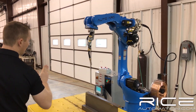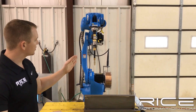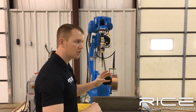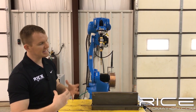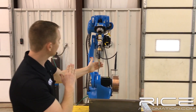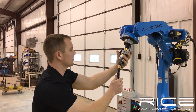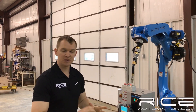The last thing on this robot body is the torch. It does come standard with a breakaway torch. What's great about the mechanics of it is that upon any kind of crash, when you have a breakaway head, sometimes that head will get stuck and you're fighting it with your pendant. What this robot has integrated into the software releases the brakes when that trip head goes off — you can hear those brakes release. And it's not just one axis: we've got J5, J6, and even J4. So you can physically grab it and move it out of any collision with your hand.